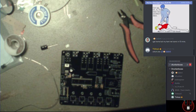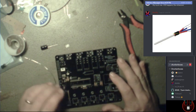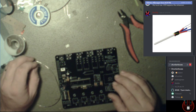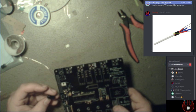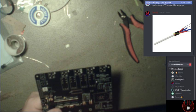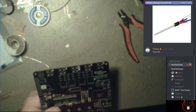The way that I'm using the vias is specifically for the programming header for the Tiny85. I have the vias under the chip, so that's not under the top solder pad, but on the back, the solder pad for the connector, which is SMD. It's a female SMD connector. Those vias are under their pads. Whenever they go to do the SMD pick and place, I have no idea what they're going to do at PCB. I don't think they'll run into problems though.